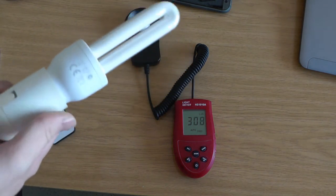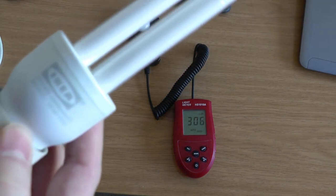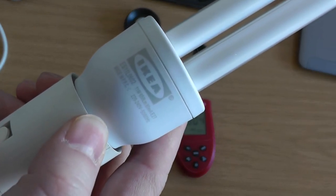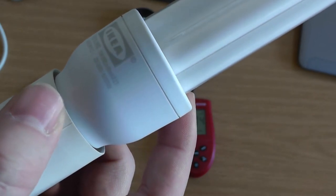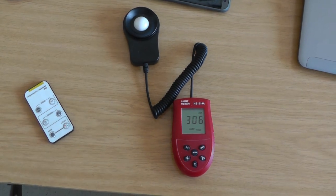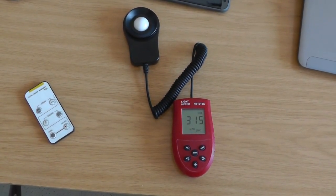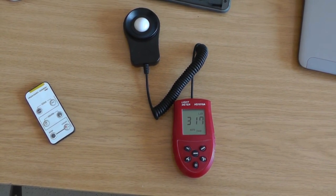For comparison, I'm testing a compact fluorescent lamp — an Ikea ES11, 11 watts, 350 lumens, 80 mA. Measuring at the same spot: the CFL only brings me from 300 lux to 317 lux, just 20 lux more. My LED installation adds 130 lux — roughly 6–10 times more useful light from a comparable amount of power.